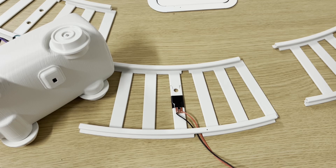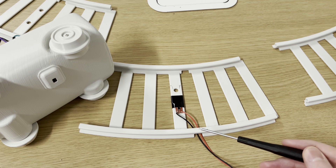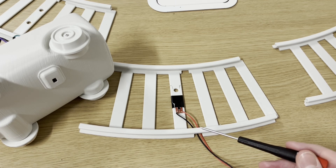Let's talk about the IR sensors. We've used the same sensor both on the track and on the robot, which may not immediately make sense. These IR sensors are intended to detect something by emitting a beam and picking up the beam as it bounces off an object, with an intended range of around three millimeters. Rather than trying to put a reflector in the readable range of the sensor on the robot, we chose to have another sensor facing upwards — its beam shines directly into the detector on the robot, so it's picking up the beam of the other sensor rather than its own reflected beam. The sensor in the track isn't reading at all; the output pin isn't even wired up. The advantage is that to get the robot to stop, all we have to do is turn on this IR sensor electronically and it'll be picked up by the robot.